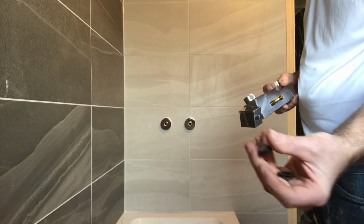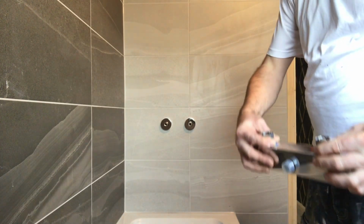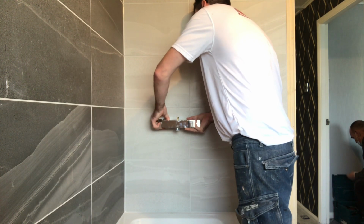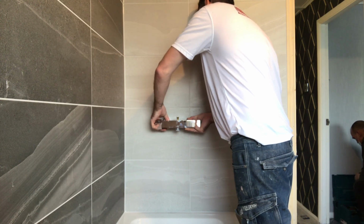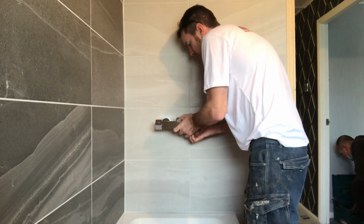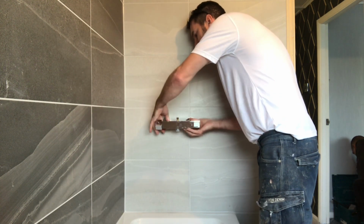Then your washers, see how he's got that donut on it? Fibre washer, hot's always on the left hand side. That's why you cut your pipe slightly into this fitting, otherwise you squash your washer. Then if you've got your centres right, sometimes it's a bit tricky just getting it on that thread, because that washer's moving about inside. So screw one side on and then get the other side. Don't tighten it up until you get both of them on. Then tighten it up.